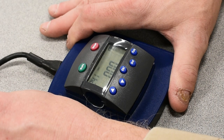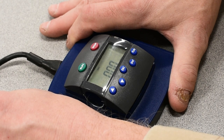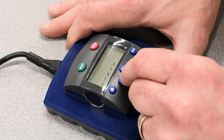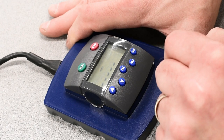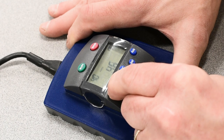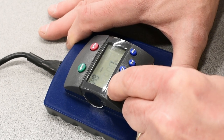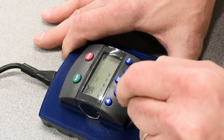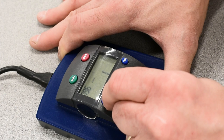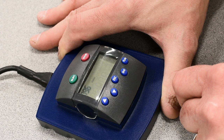Now that we have our keypad plugged in, notice the common default is to show value 241 on the screen. We'll have to change our menu and go to the parameter menu to get to 796. I first change that and then use my arrow keys to scroll to parameter 796. We determined earlier that we will input value 14 as our data set entry for this particular motor and inverter.